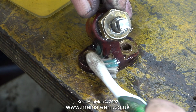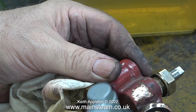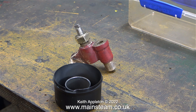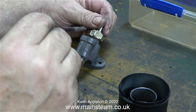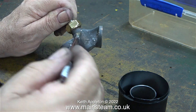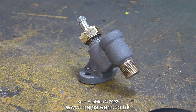If it's stuck that well, why remove it? I am however going to remove the really bad bits, and for this I'm using my Proxxon angle grinder fitted with a flapper wheel. I put it back into the cellulose thinners to clean off all the debris, and then I've sprayed a quantity of etch primer into the cap of an aerosol can. Using a very small paintbrush I'm painting the check valve with etch primer. It's a very warm day today and the etch primer was actually drying as I was brushing it on, but because this is a very good quality etch primer it dried very well.